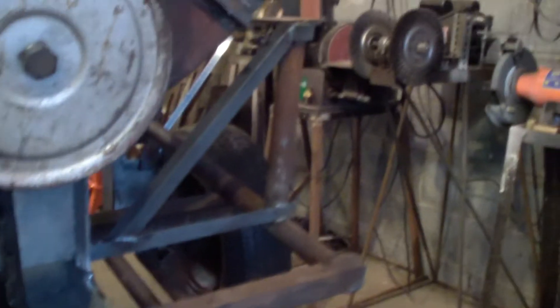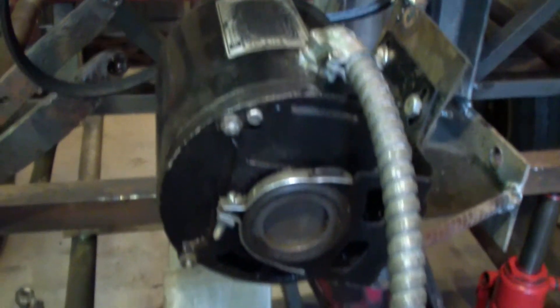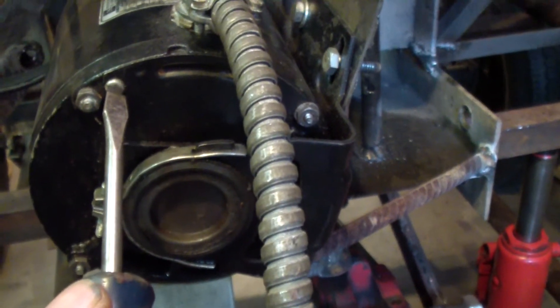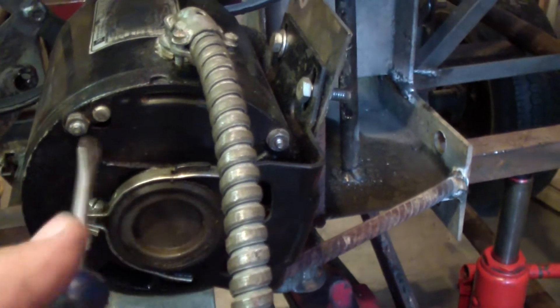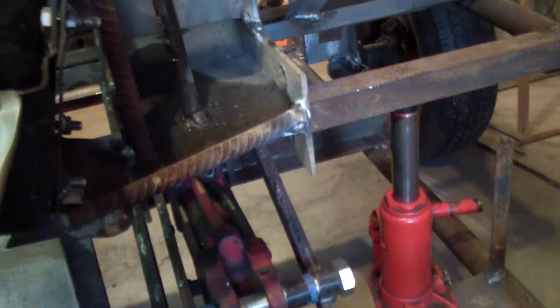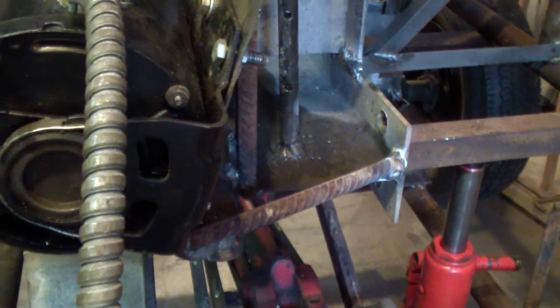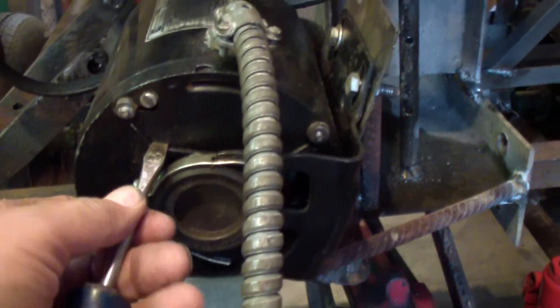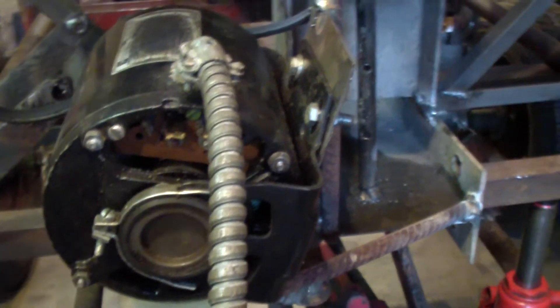I got the tires on it. A switch came in for this motor. It's a pretty simple thing to do, but you can't do it to all motors because not all motors have a way of doing it — an easy way, let's put it that way. Most motors that come from furnaces or furnace blowers usually have a way to change the wiring to change the direction it rotates.